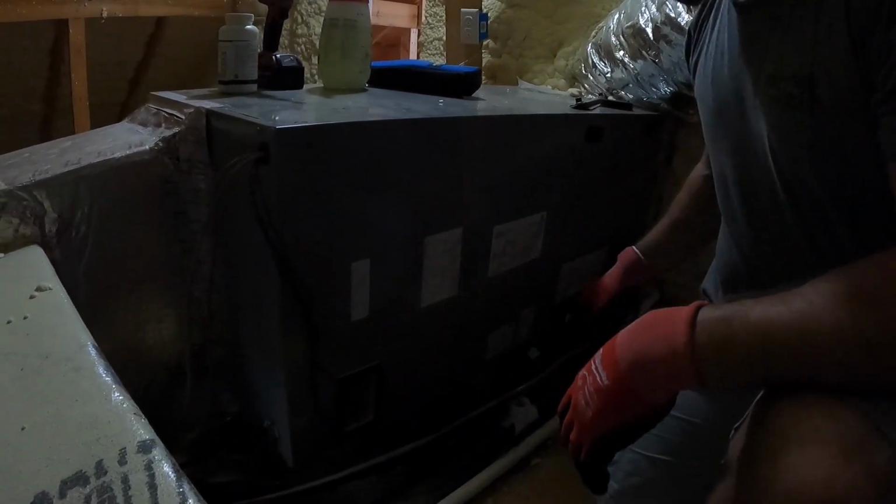Alright, so we're on the indoor portion of the maintenance visit, and we're up in an attic. This is an encapsulated attic, and this is an existing customer, but we always check and make sure we have some overflow protection. We've got a float switch in the primary drain coming off of the equipment, and then there's a pan switch here which has a float on it that's wired up to shut this equipment off if the drain gets clogged or if water backs up in this pan.